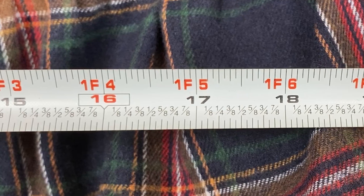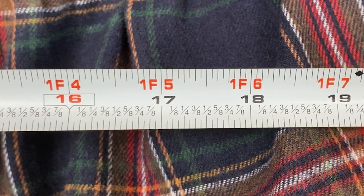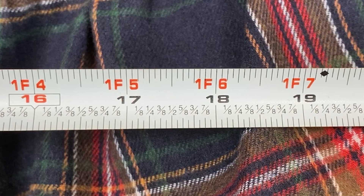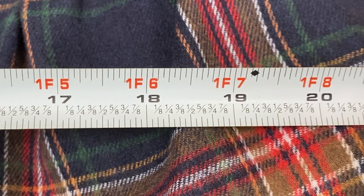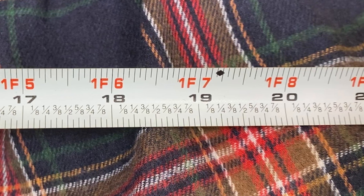That rectangle means it is the distance between studs in a house. Plus, if you go to 19 and 3/16th inches, you're going to see a diamond marking. That diamond marking is going to help you with the layout of trusses and rafters. Those markings are repeated at those distances all the way up to 8 feet, so you can measure multiple studs or multiple rafters.